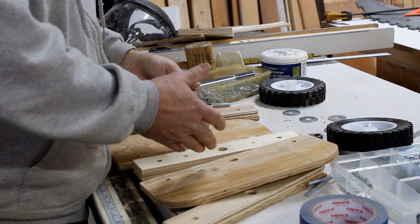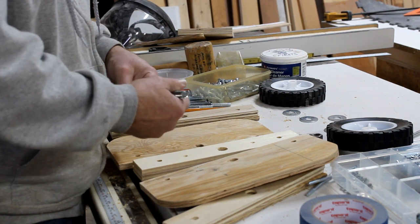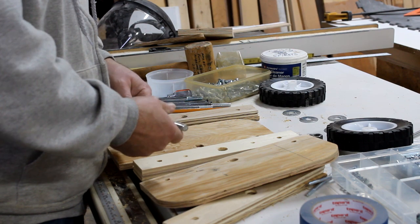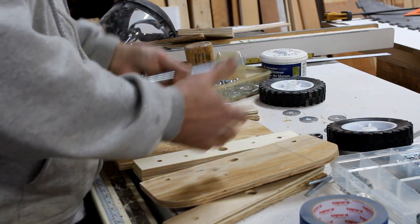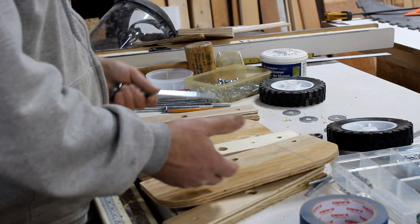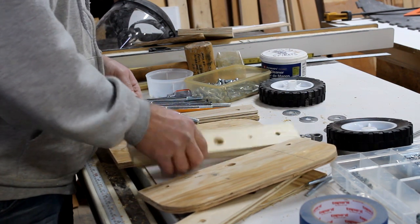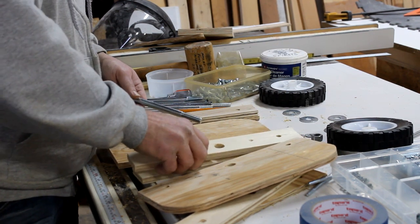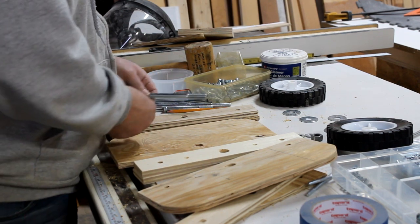Now if I wanted to do a much wider piece, maybe an exterior door, which is 1 3/4 of an inch, or I had something wider, then I could easily disassemble this, take some of the shims from the outside, add them to the inside, reassemble it, or I can make it thinner. I can use thinner shims on the inside, take these thicker shims and put them on the outside. I can adapt this to whatever size material I want to move.